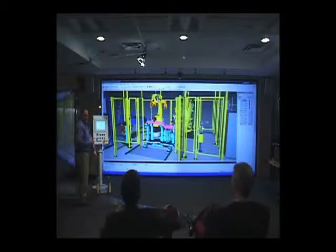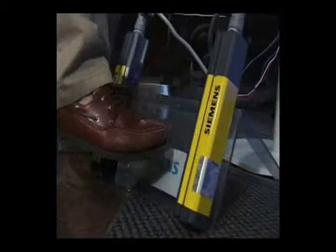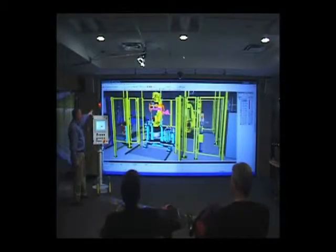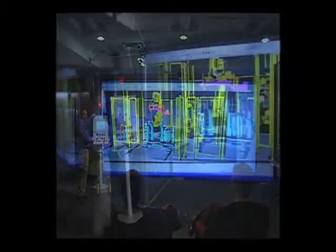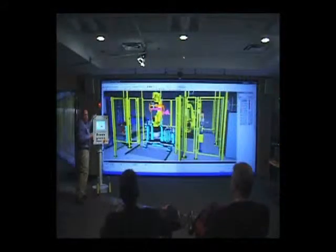During this cycle, I'm going to simulate the breaking of the light screen by placing my foot between the light screen we have here on the floor. As you can see, the robot is now picking the fixture up — the light is yellow, meaning it's in automatic. As soon as I broke the light screen, everything came to a halt. The stack lighting is red, reflecting the light screen fault, and our virtual robot came to an immediate stop. The operator is safe from any harm at this point.